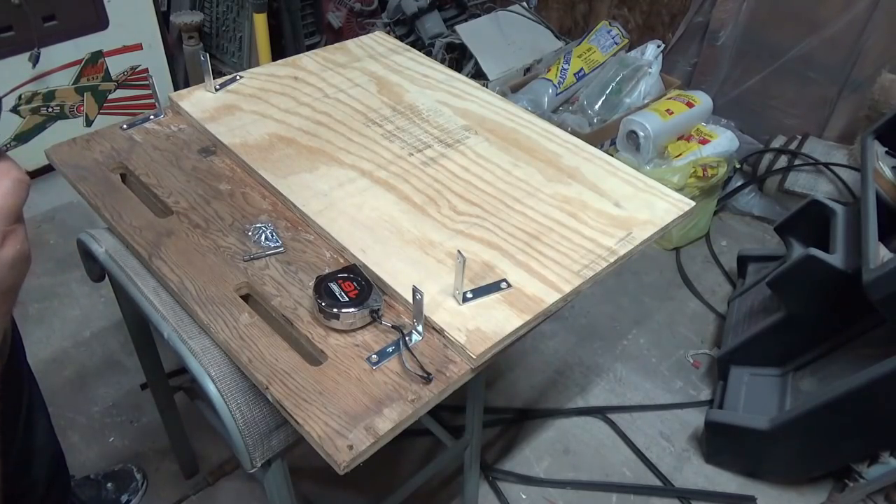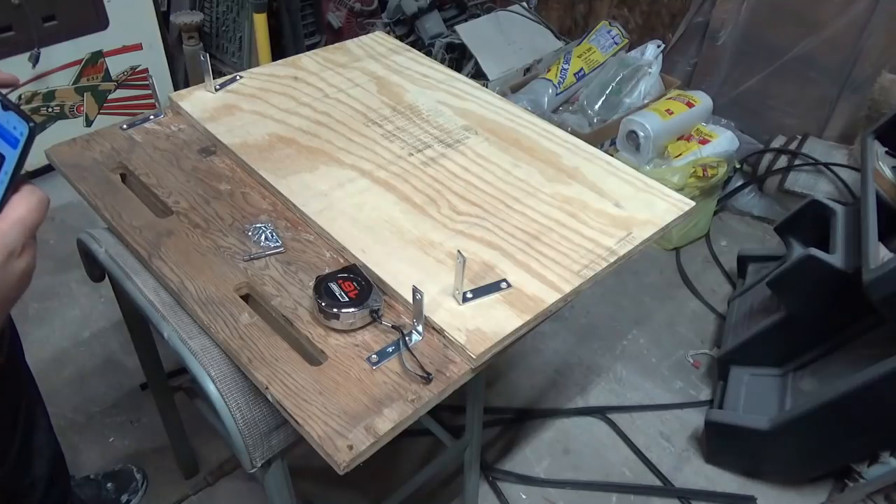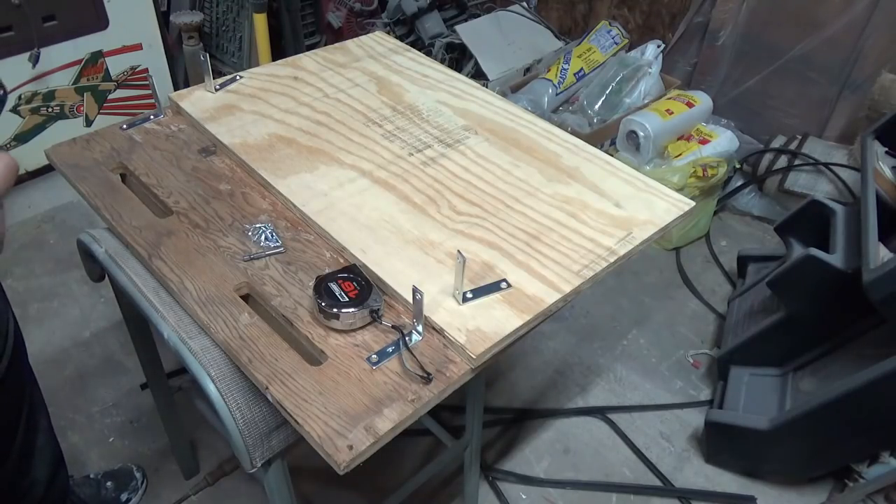In this picture, I want you to notice there's a little bracket. You see that big piece of metal sheet metal — on the upper right of that, there's a little bracket that holds a little PCB. That PCB is an external ROM board that allows a Cinematronics CCPU to play Tail Gunner. It looks like in his picture he also has a hacked board. At some point someone replaced or repaired his machine and put those two EPROMs, U7 and R7, doing the same EPROM hack that my vector beam board has. Vector Beam did that themselves.